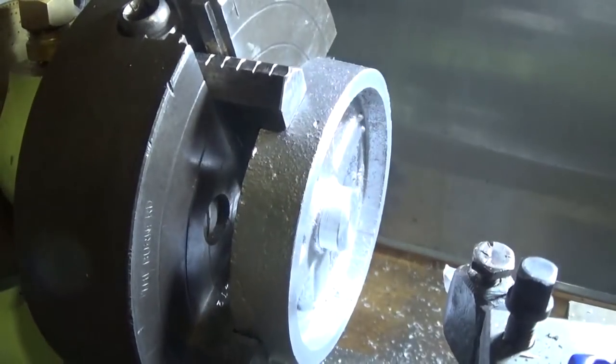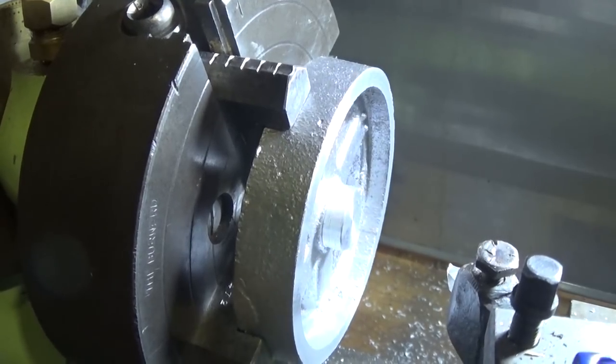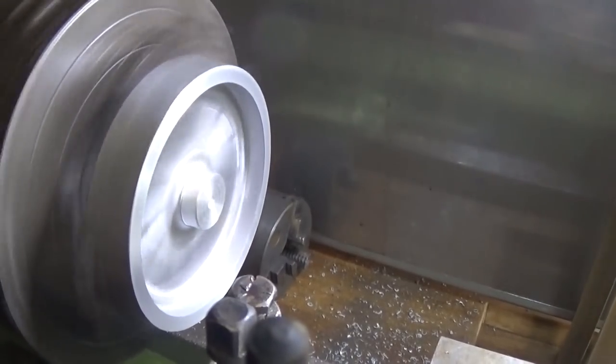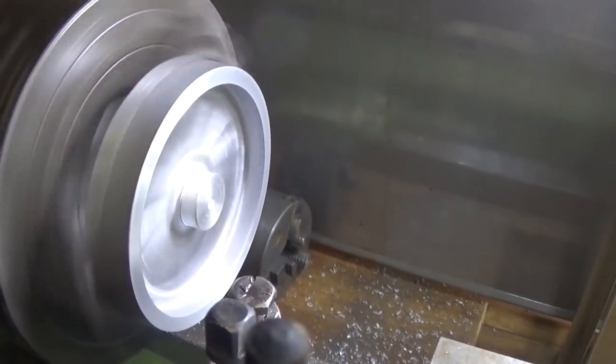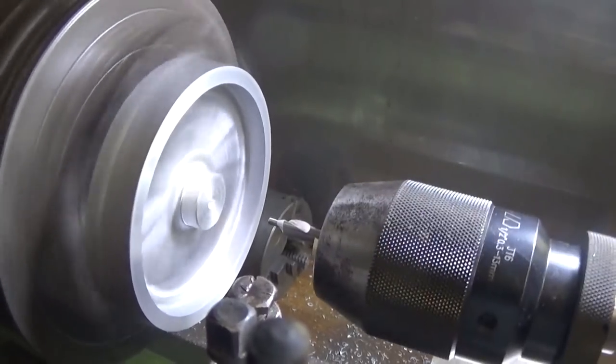They're pretty straightforward, there's not a lot to them. It won't take long to get them all down to size and looking pretty nice. Now before we take these out I think we're going to center drill these — this makes everything a little bit more concentric on the outside and makes them look a bit less wobbly whether they're actually wobbly or not. Nice sharp center drill.